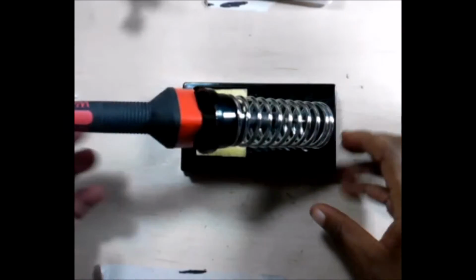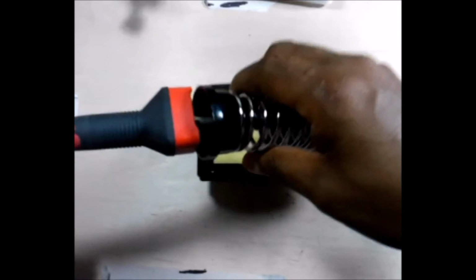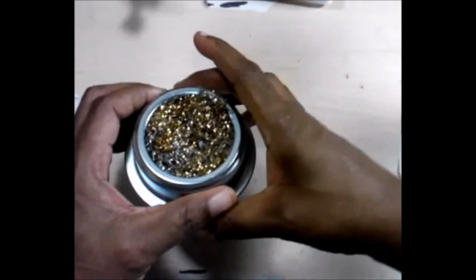and if you're going to be working with electronics, do invest in a soldering iron. This one is a cheaper one from Weller. It's the best one I've found to work with my electronics. When you do get your soldering iron, you might want to get one of these type things to go with it. That's so you can stab the solder point into there and it'll clean off the solder point real good. You want to keep your soldering iron tip clean.